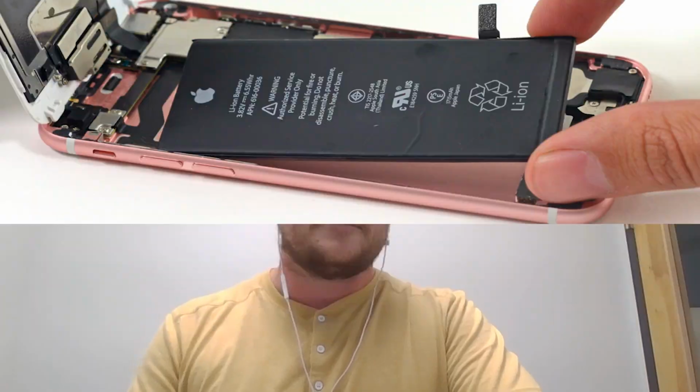So it sounds like you're working with a big range of sizes of batteries. Yes. I work with batteries from 3 millimeters thick up to 50 millimeters thick. Each of those requires a different way of interrogating it with ultrasound, but the core approach stays the same. You emit an ultrasound wave into the cell, we measure on the other side, and we make deductions based off of what signal we're seeing on the other end.